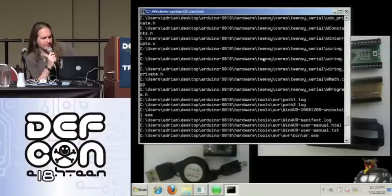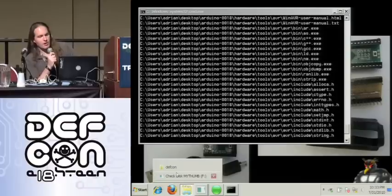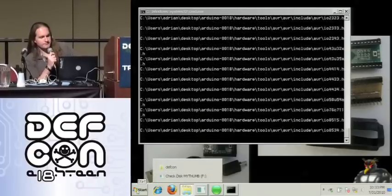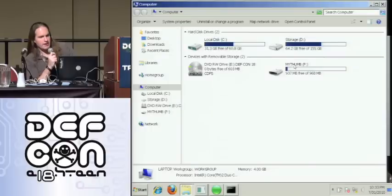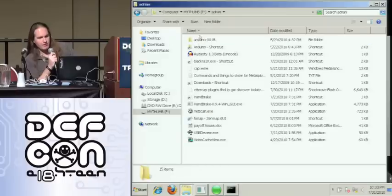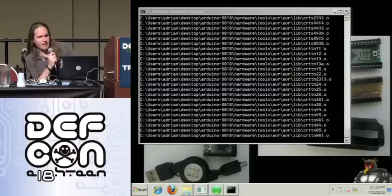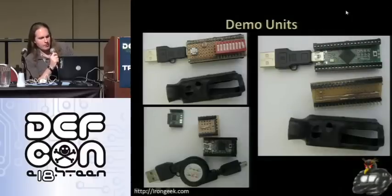The scripts I've written for that are fairly easy. Essentially, for the current logged-in user, it creates some extra folders on the drive. If I were logged into a different name it would make a different folder, and that folder would contain all the stuff off the person's desktop. So that's one example of a payload — one I can trigger via scroll lock.